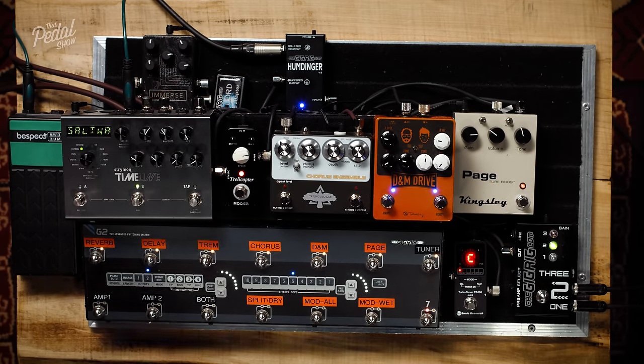And where are we with phase and isolation with that? It is a lot more complicated because you have a lot more connections between the amplifiers. Some amplifiers are a lot less susceptible to that, but ideally you still only want one path to earth. So it's just something to be aware of if you're getting noise with that.